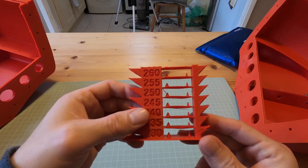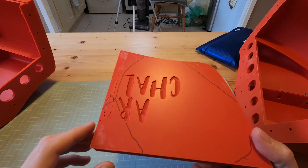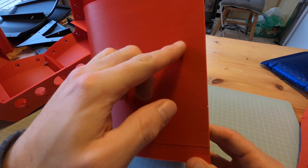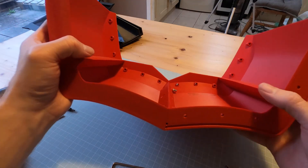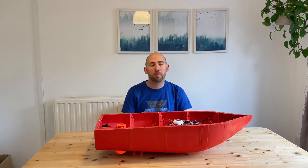With 3D printing we normally come across a few obstacles, such as printing out too hot, wrinkles on the prints, warping, cracking and generally incorrectly printed parts. One of the biggest problems that we had was warping — it was a major issue. We tried lots of different ways to improve the warping and we finally did get some really good parts, but one of the issues was that the parts have cracks in them and those cracks make the boat harder to waterproof.